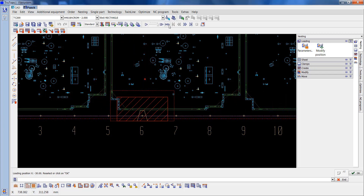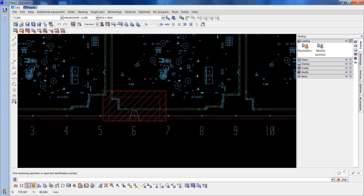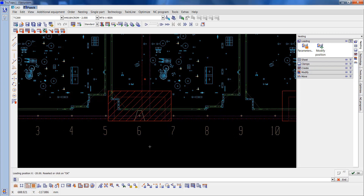It's hitting an 8mm diameter tool which is part of a multi-tool, so that can't break into the area of the clamps without it erroring out. I'll do the modify position again — this time I'll put in minus 20, which is perfect. It's in between that job and it's not hit on there.